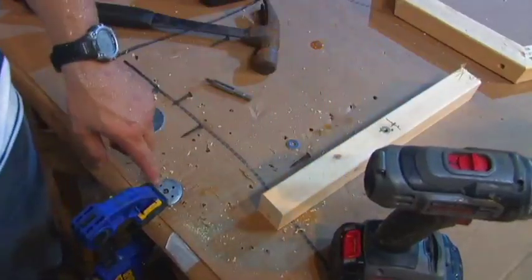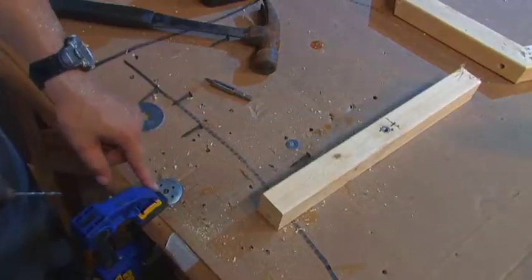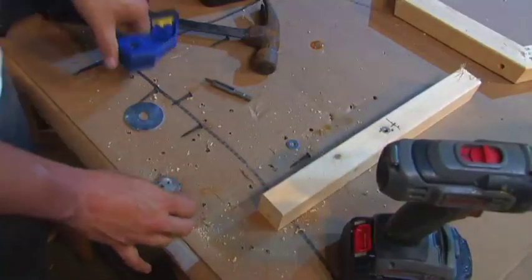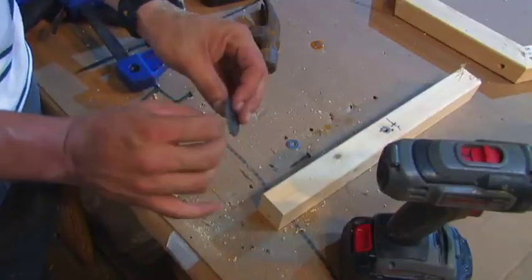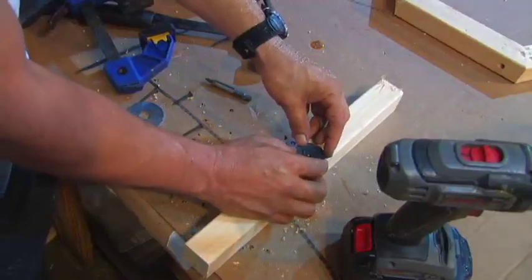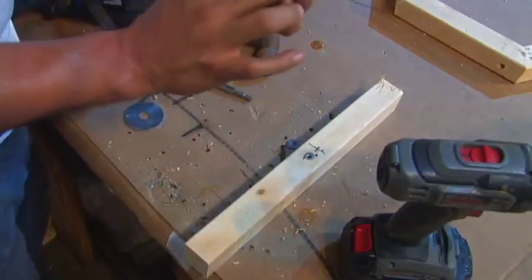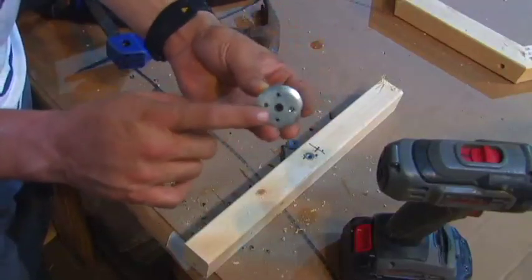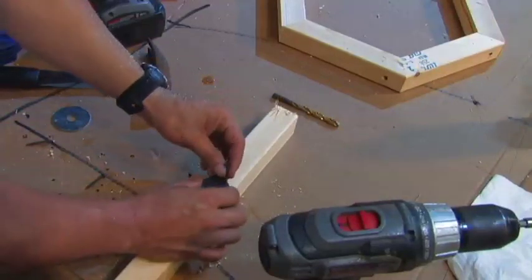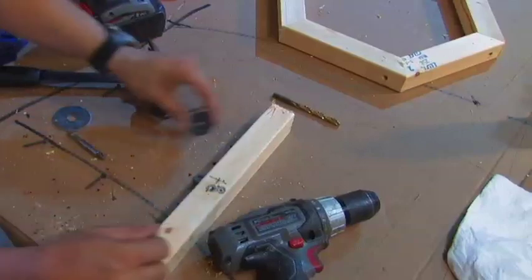You're going to want to get a flat washer with a quarter-inch hole — preferably a little bit bigger. You want a big flat washer and you drill four holes in it. You want to clamp this down — you don't want to do this holding it, because if this slips it will cut your finger pretty bad. This particular washer has rubber backing on it; you don't have to do that. You want to use the thinnest piece of metal washer that you can find, and you want to make sure that it covers this hole up. I'm going to be putting this one upside down and then just taking regular wood screws and putting it into place. You want to make sure that your hole lines up perfectly. If you have to, bore this out a little bit bigger — if the quarter inch is really tight, test this on your tripod setting and make sure that it fits your tripod. I am using one-and-a-quarter inch fine drywall screws for this. You want to mark your hole exactly where you want this to be, then use the screw to dig a little notch in there.